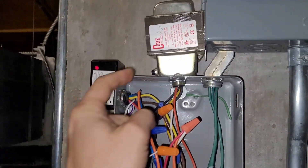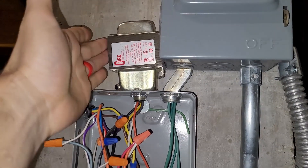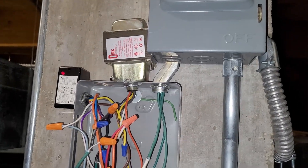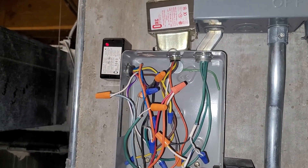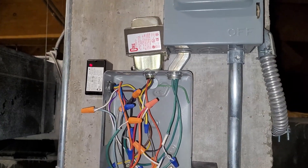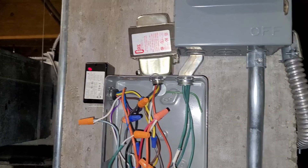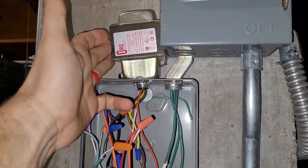You would expect this low voltage fuse to blow, but I guess this transformer pulled too many amps and the fuse in the motor starter was kind of small and it burnt very quickly. So when I found the burnt fuse, I wanted to know if this transformer was still good.